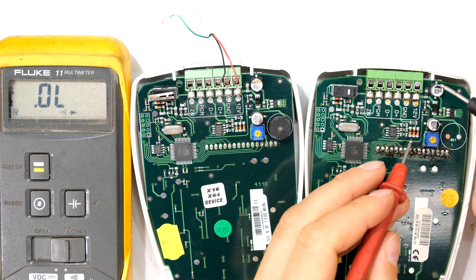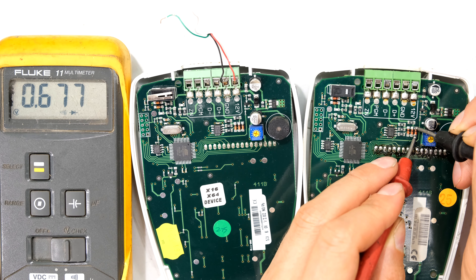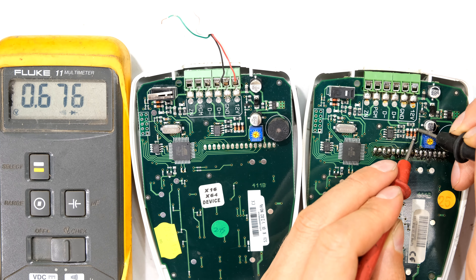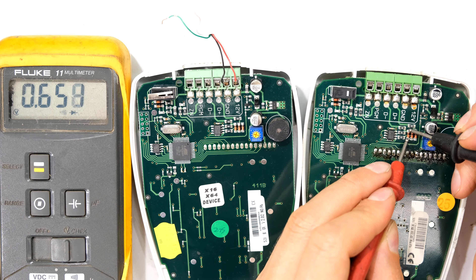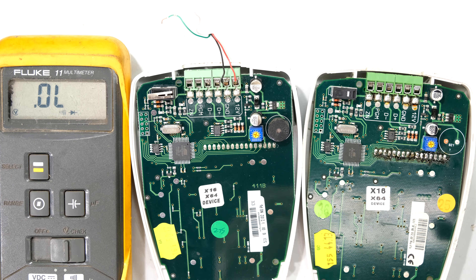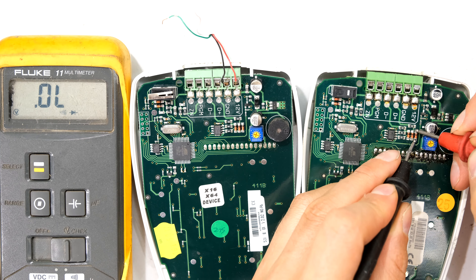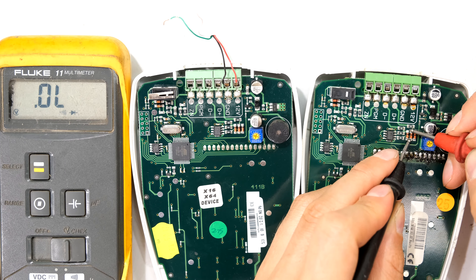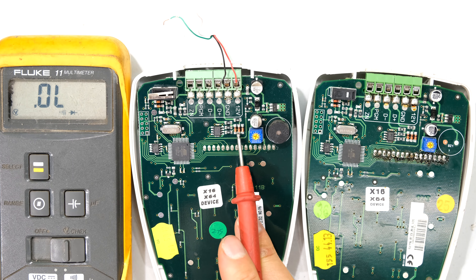Comparing to the functional board, the reading is 0.677 volts — acceptable. Forward biasing a diode is typically between 0.55 and 0.7 volts. The others also read fine. Very importantly, when doing the diode test, flip the leads around and test again. The meter should read OL — open circuit — in the reverse direction. In this case I need to remove all three diodes and both resistors and replace them.